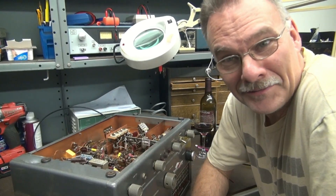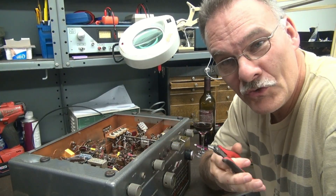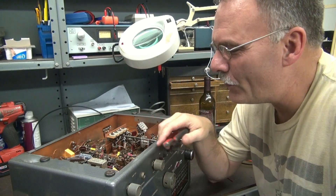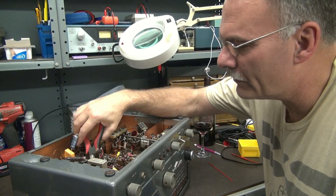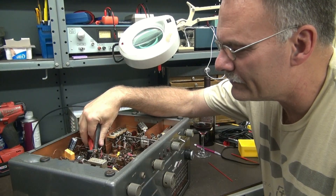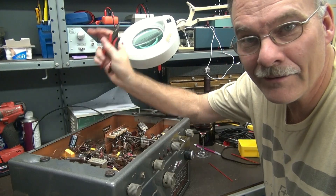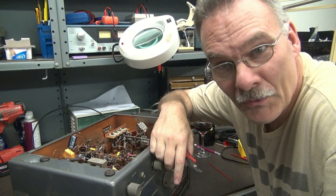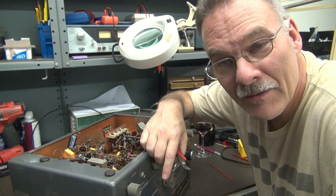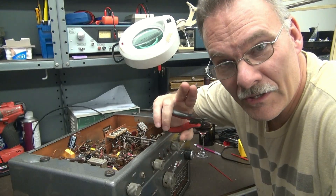Well, now you know what a cobbler is. So when you run into this situation, the best thing to use are some wire cutters. You go in there and say, we're going to un-cobble the cobbler's mess. Get all this out of here. Look at that — that wasn't even soldered. Take it out. We're going to do it right. And what's the right thing to do? We're going to put in a new filter cap, maybe add a terminal board if needed, and make a nice, secure repair.